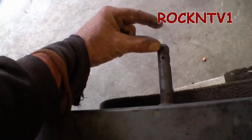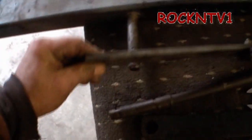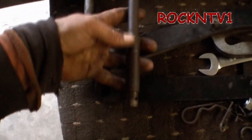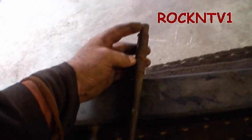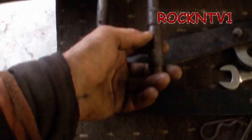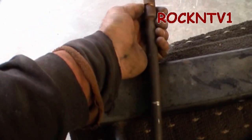The next process is to cut this out and make a new shaft — make it an inch or inch and a half longer on both sides, because I've got plenty of shaft. That way these will actually be straight in the tractor instead of all leaned and tipped. You can tell by the wear pattern on this that they were not riding straight. When I bolt this up into the tractor for the temp fitting, I'm going to try to fix this somehow — maybe stick it in my coal stove. You could see it was running just barely on these slippy sliding things, and that just doesn't make for the tractor to have a nice time picking up and down.